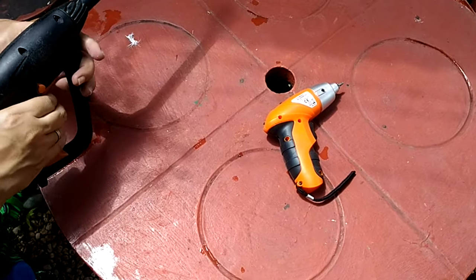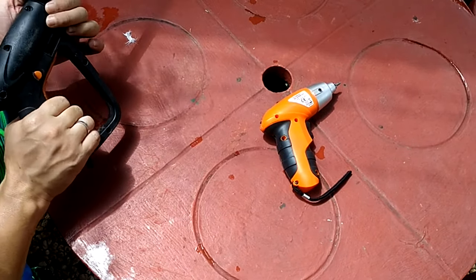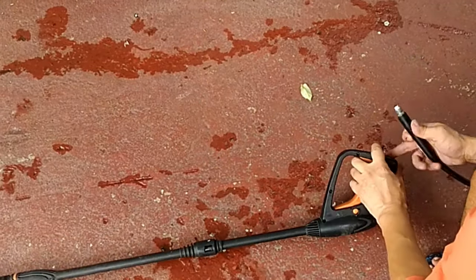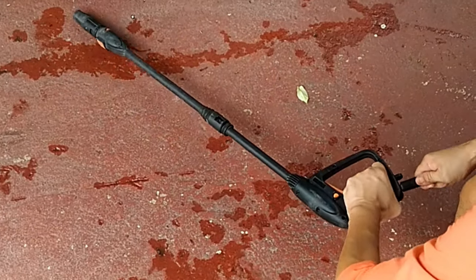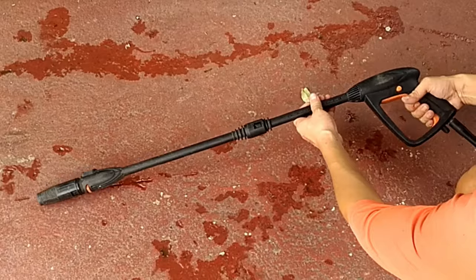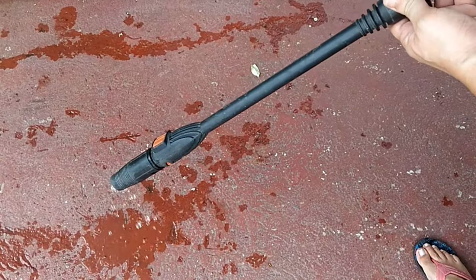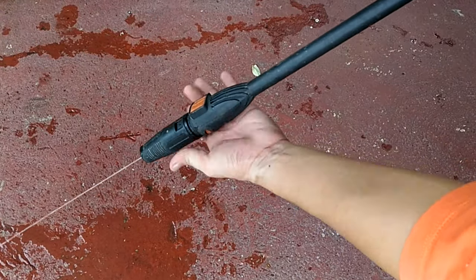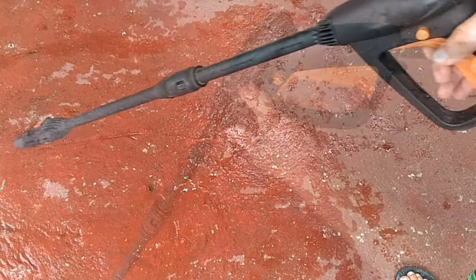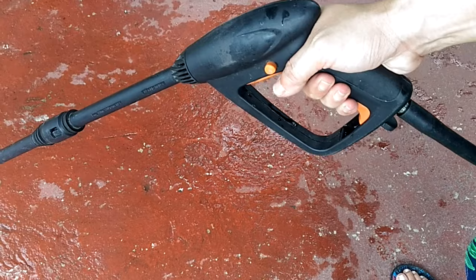Okay, let's pull the trigger a few more times. Let's mount our Teflon-taped hose to the wand assembly and make sure everything is snugged into place. Let's turn on the faucet — just the faucet for now — and test. I do see a small drip coming from the handle. Will the drip get stronger if we test with the pressure washer on? Let's test it now.